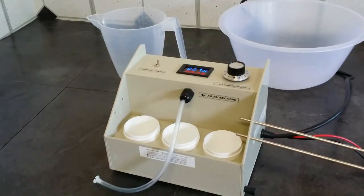Please remember to wait for about 5 to 10 minutes to ensure your solutions in the tanks warm up to about 50 to 60 degrees Celsius. This will speed up the reactions in the tank. Boiling water has to be replaced every 30 minutes because it will be cooling down, but please do not worry, this is enough time as an average plating process takes approximately 1 minute.